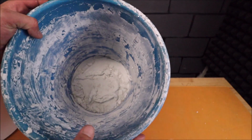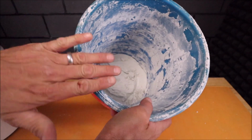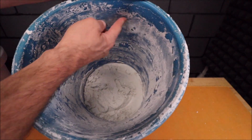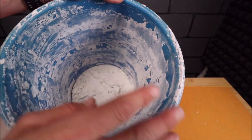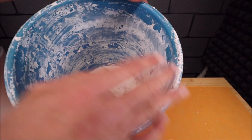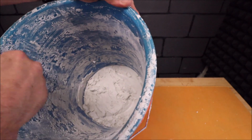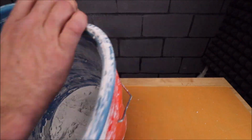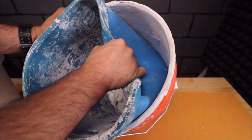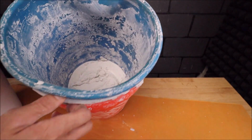Okay, so we have Schluter All Set. Very, very aggressive thin set. It's been sitting inside the liner for 2 weeks now. Did no cleaning on the liner here, the edges. Did not wipe it down. So let's see how easily this comes out and how we can clean up all of the sides here. So it's stuck in there pretty darn good. There we go.